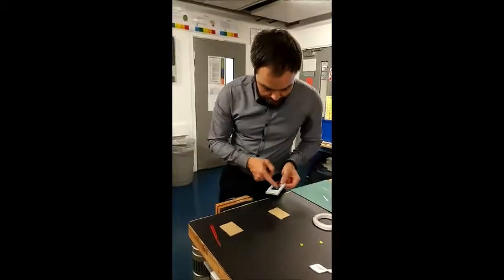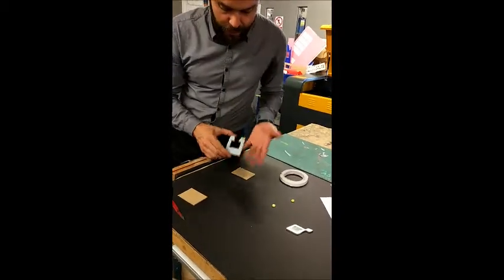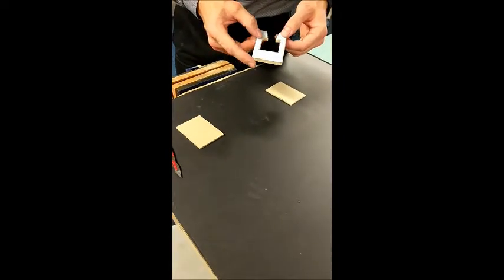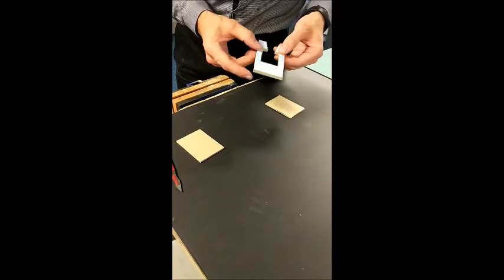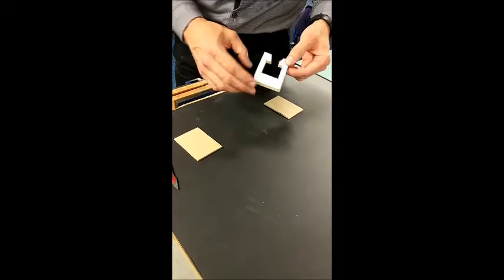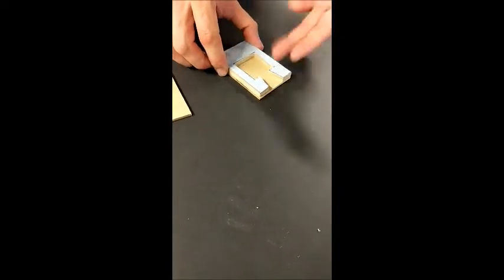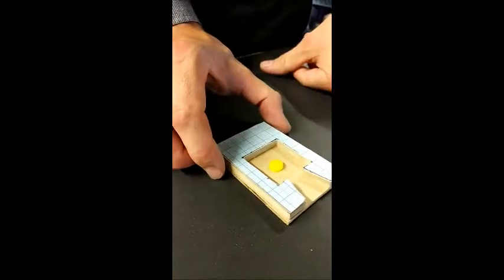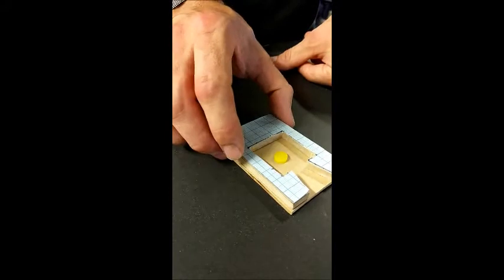In my last video I was refining the edges of this by cross filing and drawer filing with a file. You could use sandpaper or glass paper — this generally works quite well with wood. Now, what I could do is assemble this mould. It's just a three-part assembly, and if I pour my pewter in there it will produce my mould. But what I'm going to do to make it more interesting is put an acrylic insert inside and encapsulate that around the outside with the pewter.